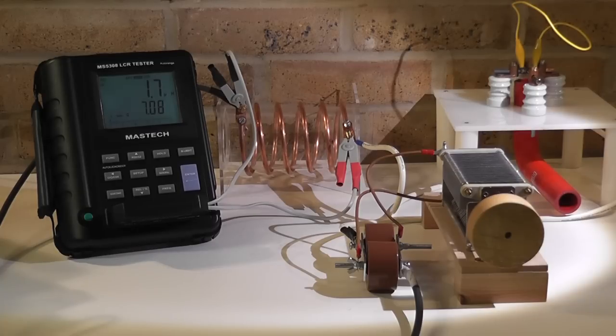As you can see, what I measured with my previous LCR meter was 4 µH on the coil. In fact it's not even half of it. So when you start to measure and use any kind of tables, we probably can't trust them much. The best thing is if you have good equipment and can measure directly — that's your best choice going forward. That is the coil directly measured.